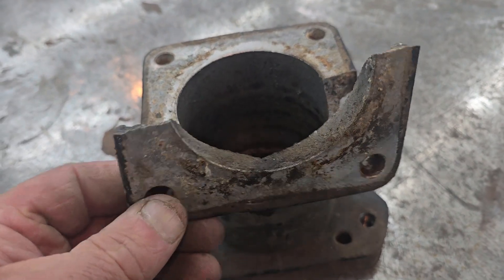It is a very contaminated thing and that's the big problem you run into with aluminum — not only is it a pain when it's contaminated like this, exposed to oil and grease and everything else, but when it's cast it's extremely porous and that contamination is going to be even worse. I can see rust where this must have been exposed to steel or bolted to a piece of steel. It's also powder coated — that black on the outside is not paint, it's powder coat. Plus the grease and filth.